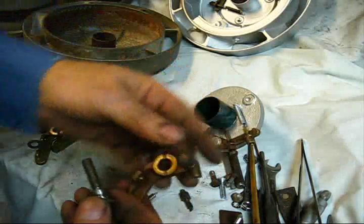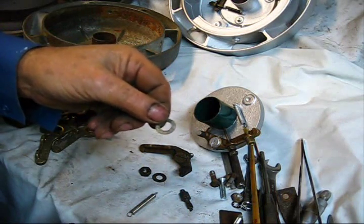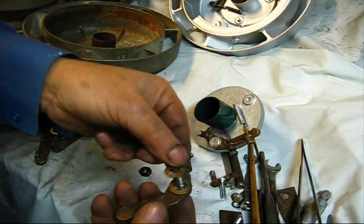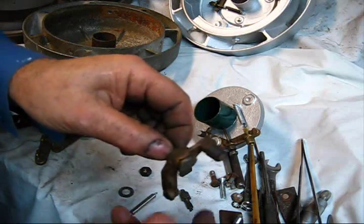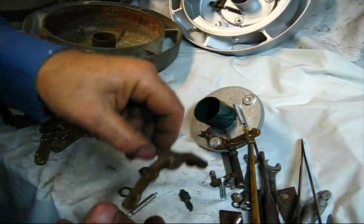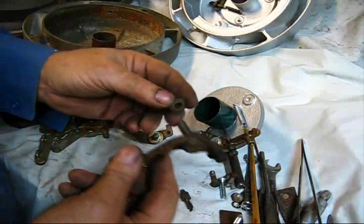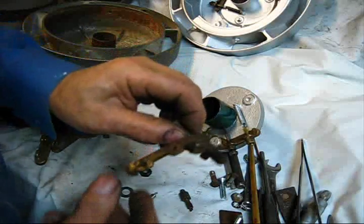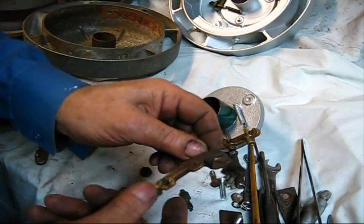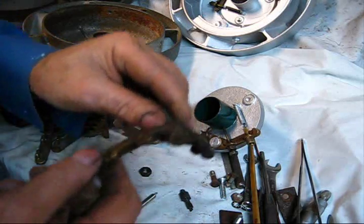The way this thing goes, it would be in this position right here. This washer was in an engine and it's too big — way too big. Do not use that. You need one that is the correct size, because that needs to be really, really free. This one in a dirty condition as it is would not govern correctly. If this was on there and tightened up — see that? I have to actually move it, and it's tight enough to where it would not slang out, it would not govern. So if you have one of these that's not free, your governor is not going to work.